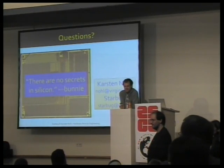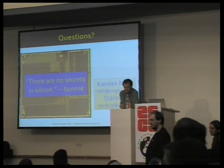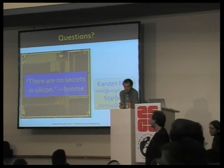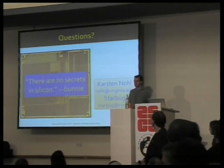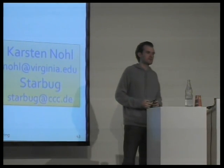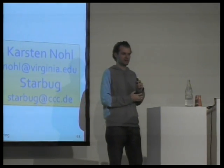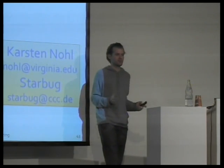Manufacturers tend to use glue logic in their newest chips. Doesn't that make detection of logical gates much more complicated because they are not recognizable that easy anymore? I haven't seen a chip that wouldn't have been assembled from a standard cell library. I think glue logic is really just used to fill gaps, from what I understand, rather than building the entire chip from it.